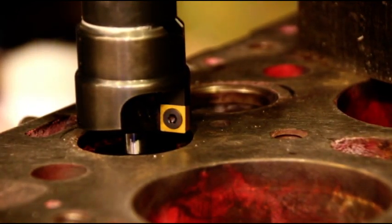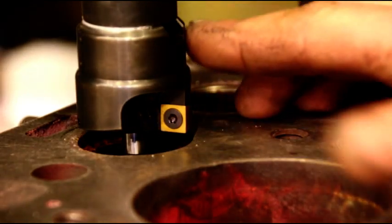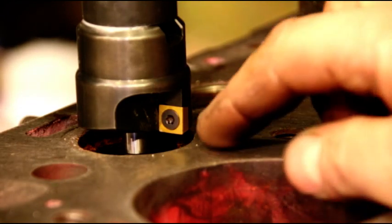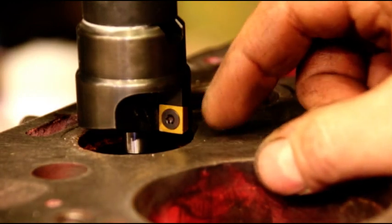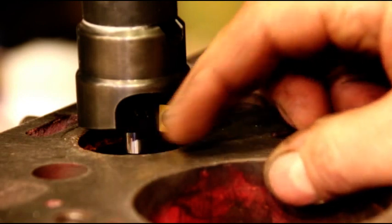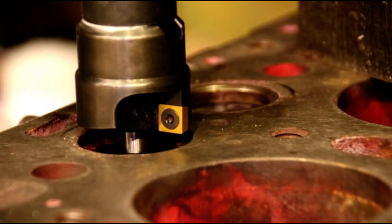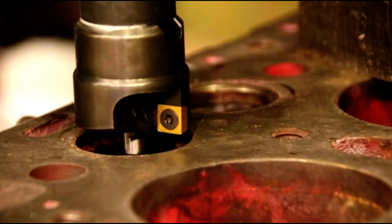Back on the F-head again. What I have in here right now is a valve seat cutter. We've got all the stitching pins on this side of the seat, so they have to be milled out perfectly. We're going to clean up the walls and just tickle the depth a little bit so the new seat goes down in there. Once the seat's in there we can head over to the milling machine and deck the block — a lot of steps to get everything just so.